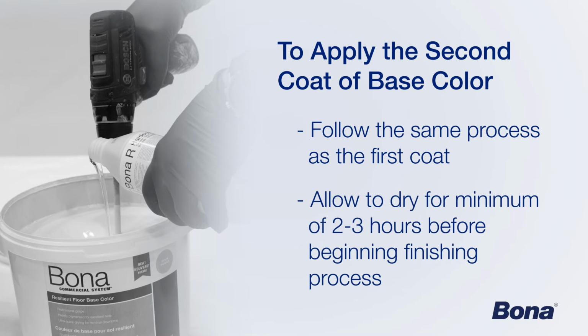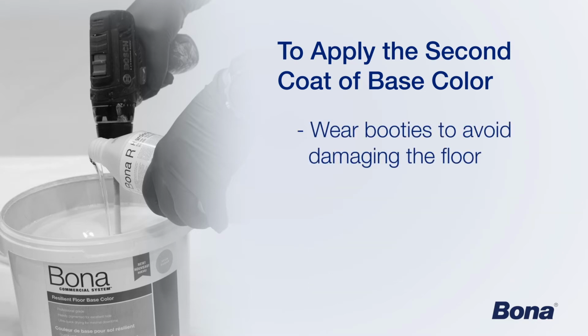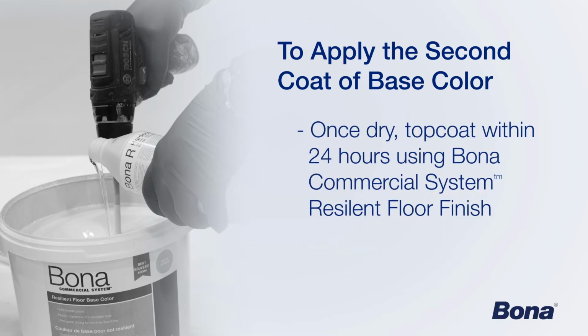Allow the final coat of Bona Commercial System base color to dry for 2 to 3 hours before starting the finishing process. Be sure to wear booties to avoid leaving any footprints if applying a second coat of base color. Thoroughly wash all application tools with water and place them in airtight containers for storage. Once dry, top coat within 24 hours using Bona Commercial System Resilient Floor Finish.